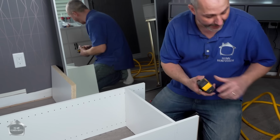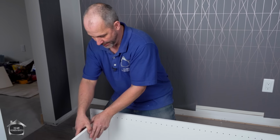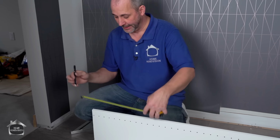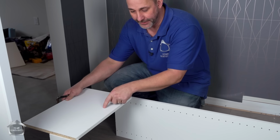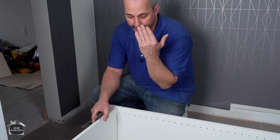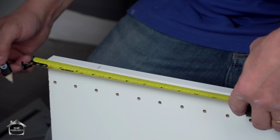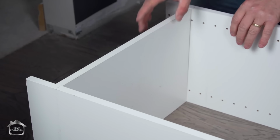Now, we're going to do the same thing at the other end. Knowing that we're putting in a 1x5, we'll set the height of that shelf as well. Here we go with our shelf. Again, 1x5 is 4.5 inches. Now remember, we cut these at 95, so they're going to be short of the ceiling. So we're going to have a piece of 1x5 coming across the top so that we can put our crown molding on it. This shelf doesn't need to come flush to it, so we're going to intentionally install it closer to the top, just so that it becomes a visibly finished space, okay? So we're going to assume that we're 1 inch from the ceiling, and we're going to go to 4 inches after that. So I'm actually going to mark it at 3, all right? And you'll see the effect when we're all done. This is going to work out really nice.